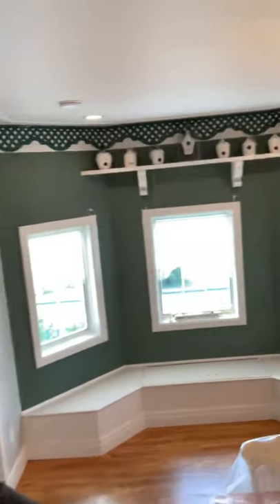What I'm working on today is going through and filling in all along that border and doing all my seams with joint compound. I'm going to do this through the entire dining room, which is a big room — seal in the border and all the seams. Then I'll go back through and hand sand everything so it's nice and smooth. Once that's done, I'll put a coat of oil-based primer on, which will seal everything in — seal that wallpaper down to the wall — so hopefully the wallpaper will never come off. Then I'll be able to paint.